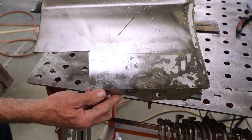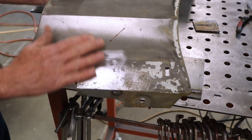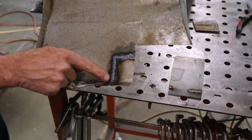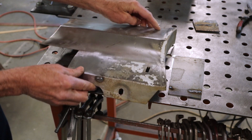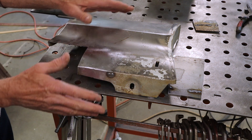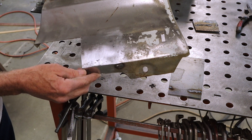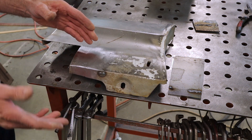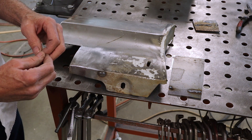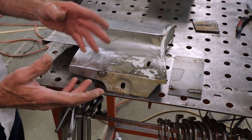We've got that ground up real nice — came out really good. I did hammer and dolly this, I couldn't help myself, but it came out really nice, basically ready for body filler. You can see the heat affected zone on the back — not too bad at all — and we got full penetration. I didn't have a heat sink underneath it or anything like some people will do, so that was wide open just like it would be on a car. For 140 bucks, you can do project work on your car or truck. The form factor is super small so you can put it up on the shelf. Another $20 for a regulator and you're ready to go.